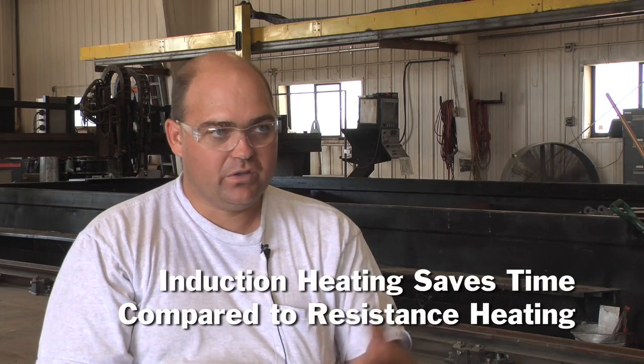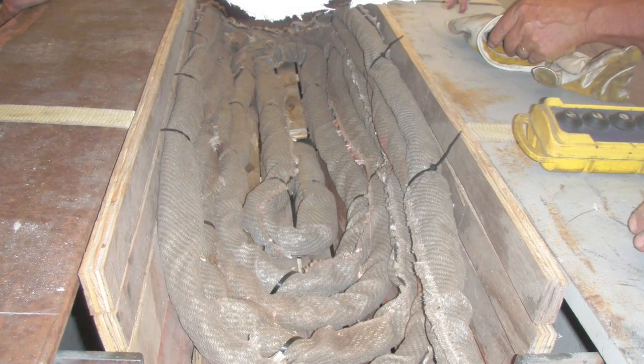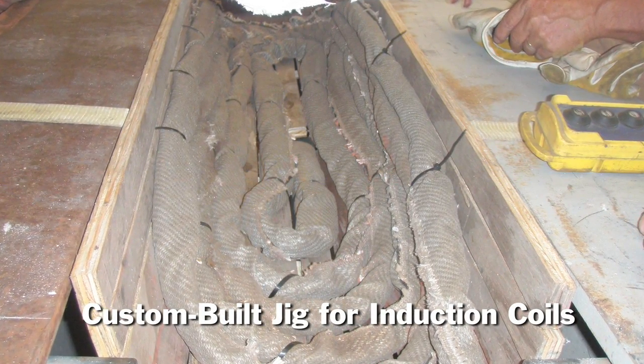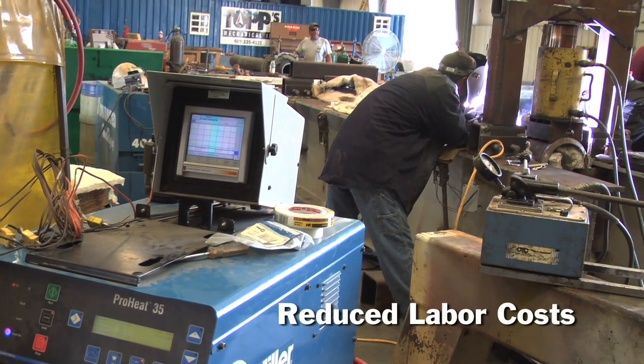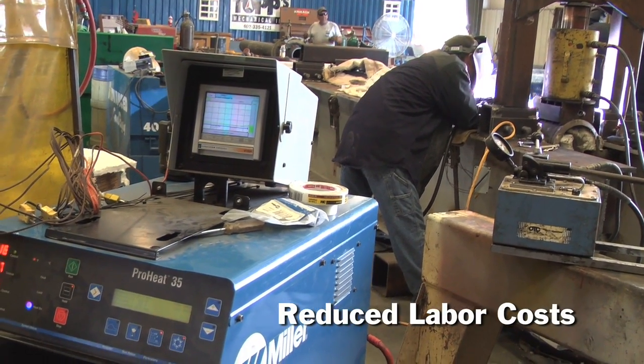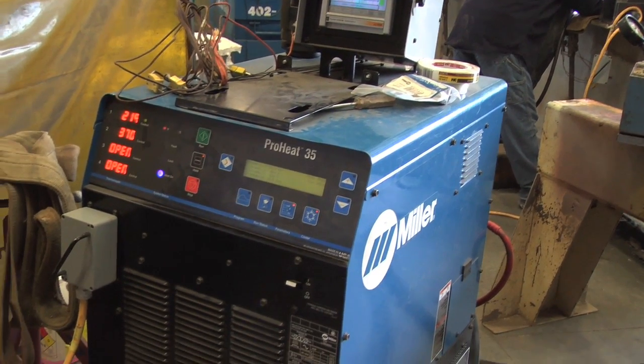In the field or in the shop, if you've got one individual weld, you have to wrap it every time. It's about half or a little less on the wrapping time. They can do that and be doing something else while they're monitoring the machine. Before, I had to hire an outside company to come in — they'd wrap it and then stand there, and you're paying their labor to stand there and watch your guys work. Now I have a guy that works for us who can be a heat treat technician, but he can also be doing other things and still monitor the machine.